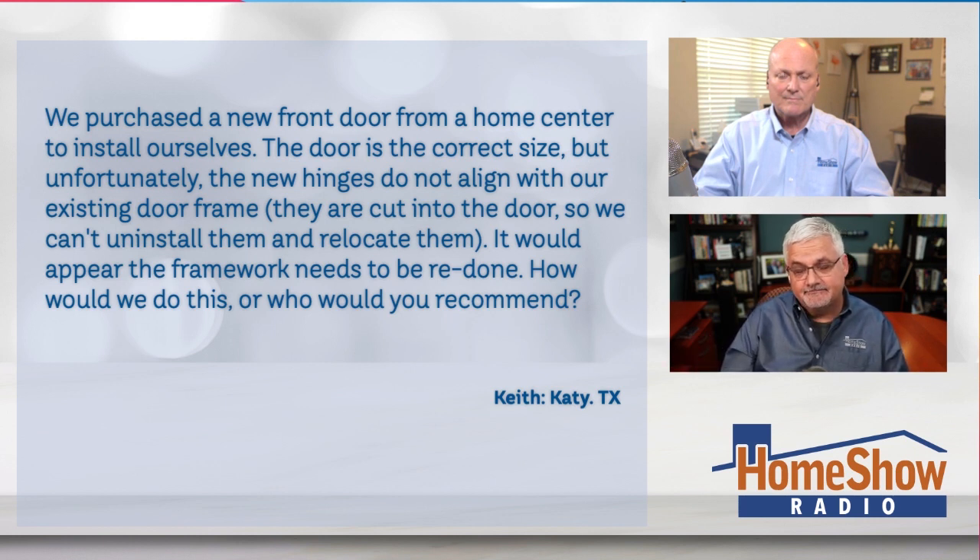He's right there in Katy. Okay, there are several options. For anybody buying a door, if it's set for hinges, you're going to have either three-and-a-half or four-inch hinges, and you're going to have square corners or rounded corners, so always take a look at that. Hinges on a door that you have are never going to line up with a door that already has hinges mortised in there, so don't think it's just going to be an easy swap — it doesn't work that way at all.